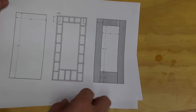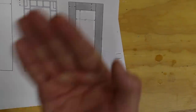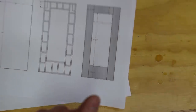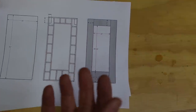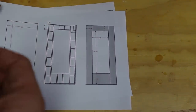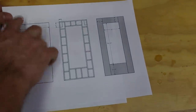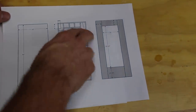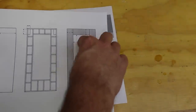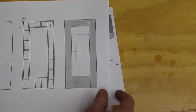Here are my plans — I've got three views of the end result. I want a framed mirror with the mirror recessed. I'm worried about breakage since it's glass, so I want a way to repair it and don't want to build it in permanently. I'm going to make the back 38 by 82 inches, attach the grid onto that, then attach a front with a recessed section where the mirror fits in, and use some little battens to hold it in place.